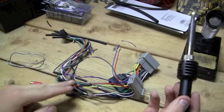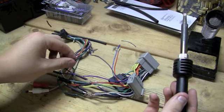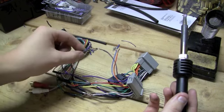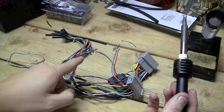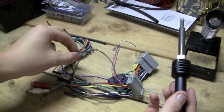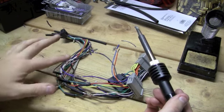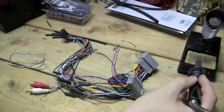Before you move to your next wire, go ahead and let it sit there for a minute. And actually be careful, because I just noticed I messed up. If you have your shrink wrap, don't put it too close to where you're soldering, because I actually just messed up. The shrink wrap went ahead and shrunk because it was so close to the wire and I took so long to solder it. It actually started shrinking already. So basically you'll want to do that, except have your shrink wrap way far away from where you're soldering it. And you'll just do that for each wire.